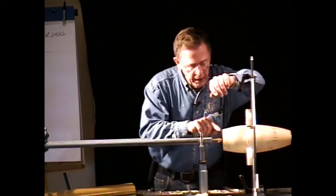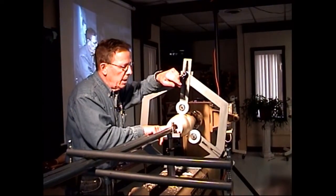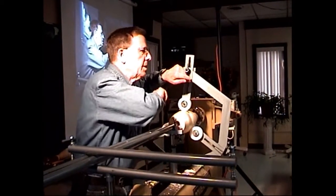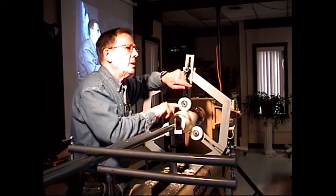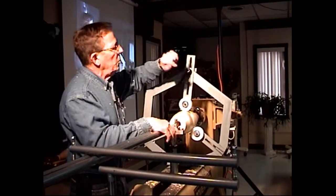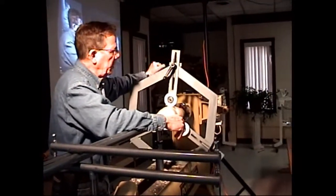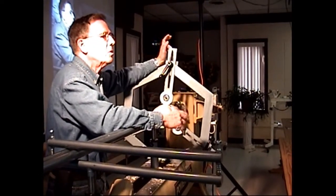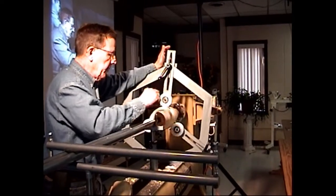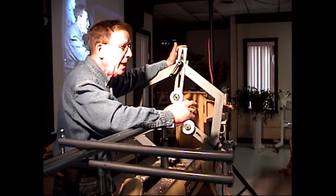The thing I started out to say was the wood has to go down through this cutter, across the top of that cutter, and squirt back out the top. While this is an extremely efficient way to do that, if you get your speed up too high, it simply is not possible for the wood to make that corner and come back quickly enough, and you'll lose the efficiency. So you want to toy with the speed a little bit, keep turning it up until you begin to not do quite as well, and then back off a little bit and you're at the maximum point of efficiency. You can open this up quite a ways when you're on green wood like this, and you can get some really big, heavy chips out of this thing.